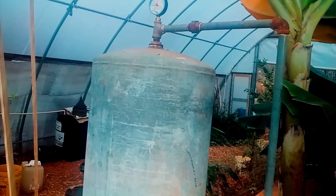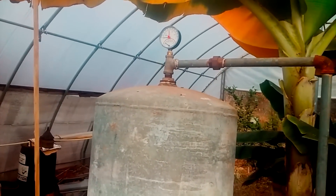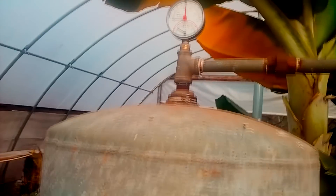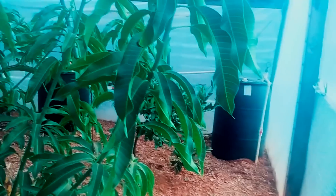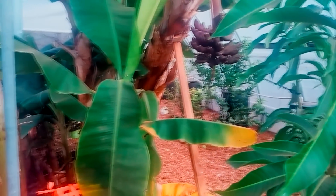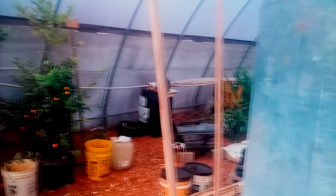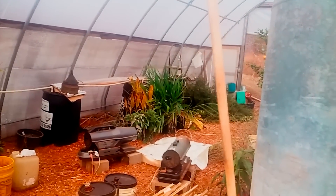That's about a 35-gallon water tank. Each one of these drums — there's 10 or 11 drums in here — they're all full of water. This tank gets heated up by the fire and it circulates through all of these drums and then comes back. I only start it up if the temperature is going to be below 25. If it's going to be above 25 degrees, I let the torpedo heaters over here make up the couple of degrees difference. They don't use much at all unless it goes below 25.